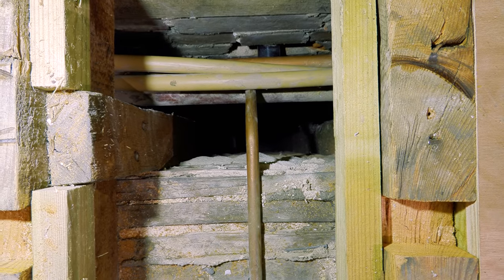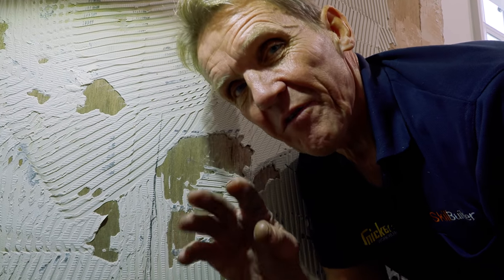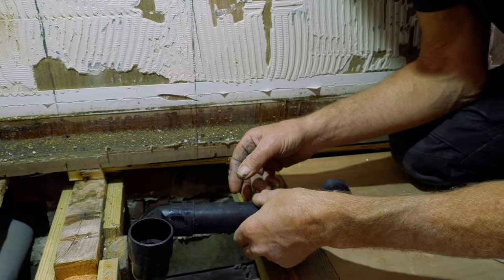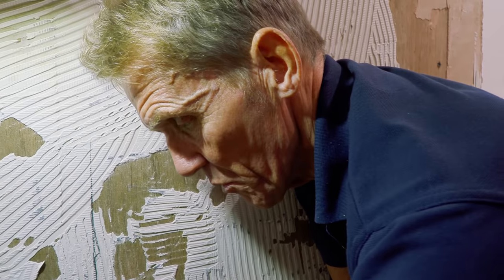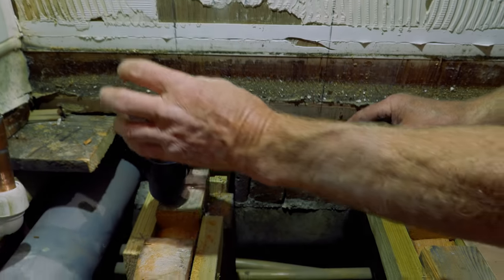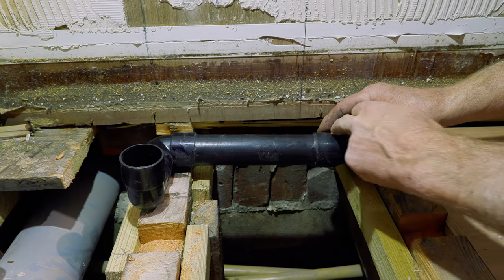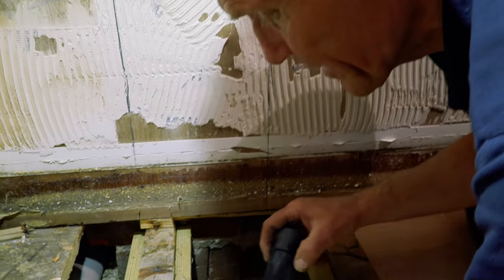You see down there, have a look down there, right down there is the pipe, which I've already cut with a handsaw, and I've smoothed the end off with some emery cloth. Now I've got to get this fella down. I've prefabricated this whole joint so that that will basically sit there, but right down there at a low level. And then I can put my other pipe into it, but it saves me having to make up all these joints, which I'd never have done down there, all right? So we've got a prefabricated section.